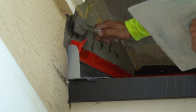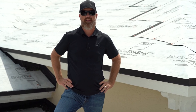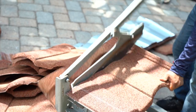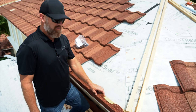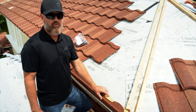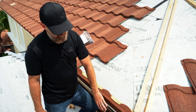One thing that's nice about doing a stone-coated steel roof as far as the install goes is it's a clean process. On a windy day like today, you'd have dust going everywhere if we were cutting tile up here, so it makes for less mess. The next layer put on over the peel-and-stick is a one-by wood drip, and then the Boral stone-coated drip goes over top of that.